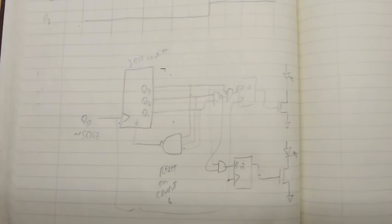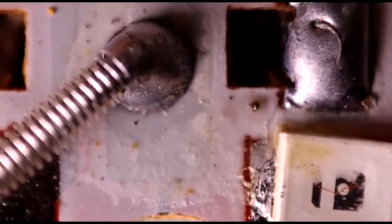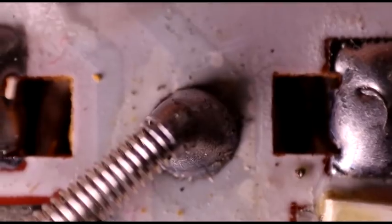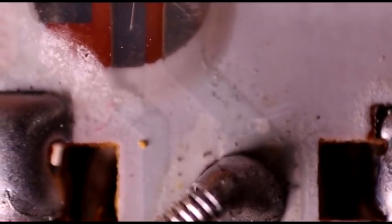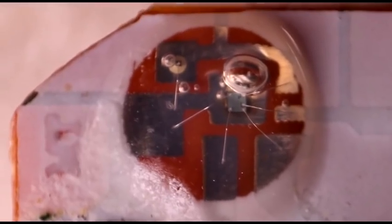That's how they drove the cost down to essentially a small amount of money. That's all that's in the assembly, and that's how the designer is able to produce such a cheap function. That chip would be incredibly inexpensive to produce — it's obviously a very large process node and a tiny number of transistors, so the yield is quite high. They can package it onto a cheap phenolic circuit board, attach the batteries, and send it to market — probably no more than 20 cents for the entire electronics assembly.